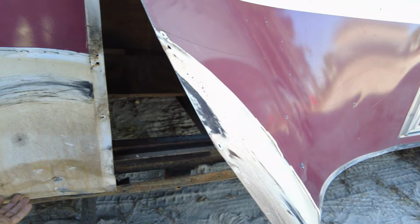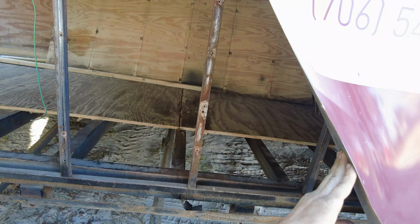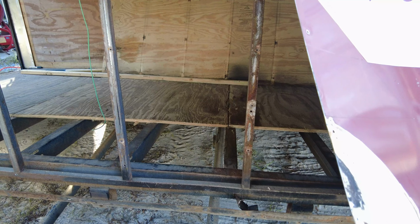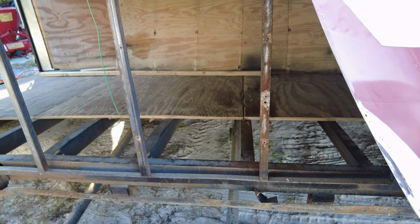Yeah. It'll come loose and your frame is bent. Oh, yeah. Everywhere there's a piece, yeah. Be careful you don't want it to cut each other. Everywhere that piece is, it's ripped out. So I'll be fixing the holes, repairing the track, and the frame is bent right here. I'll be straightening that out, putting it tight there, bringing this back up to where it goes, fixing it back in place, and going back, straightening these out, and putting it back together. There'll still be some kinks in the metal, but it'll be behind the tires. That's fine. Go with it.